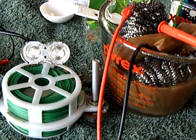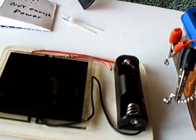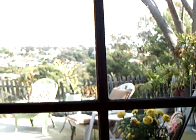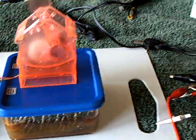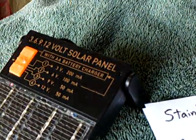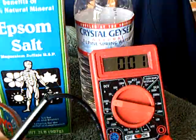It was for demonstration purposes only. I've been testing this cell with free energy — solar energy, specifically ambient solar energy coming into the house any day. We've had rain here and it's been cloudy, and it's still been running for two weeks. Let me show you how this works — I'm going to hook up this solar panel. It's on a three-volt setting; I've pulled the batteries out of it. It's on three volts, 200 milliamps if it were in direct sunlight, so probably less than 100 milliamps here. Let me hook it up and show you the voltmeter climb as this accepts a charge from ambient light.